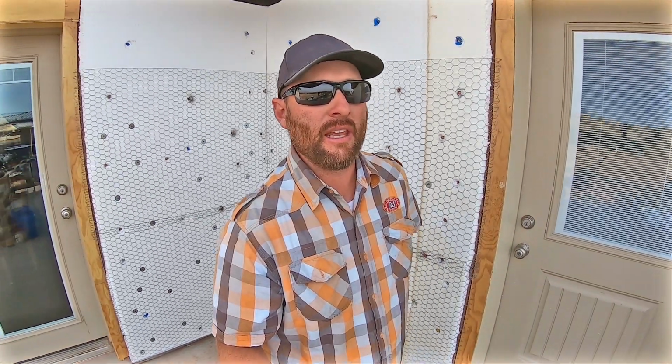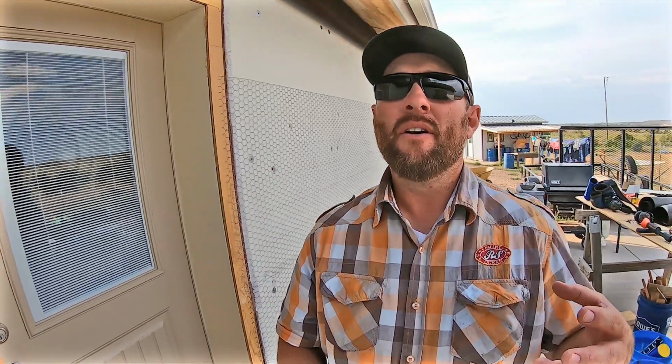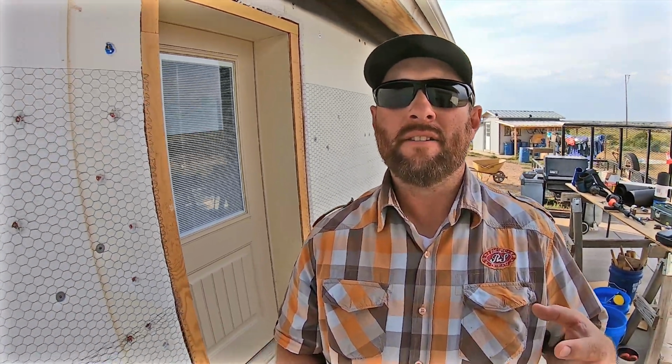And we ended up putting this foam board on this last fall. And I've got to tell you, we were absolutely amazed at seeing how stable the temperature in the house was. Now, the thermal mass of these blocks is amazing, and once it gets hot in the house during the winter, it stays hot, and then once it gets cool, it stays cool. But like I said, putting this insulation board on has just been able to maintain the temperature.